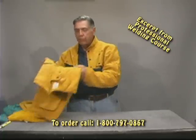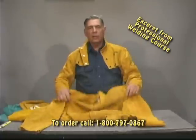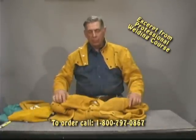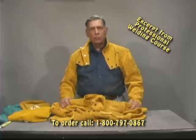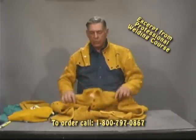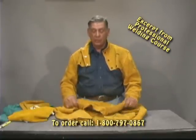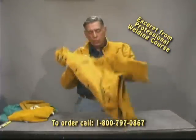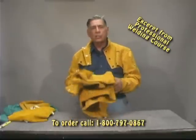It's a lot lighter than using a full leather jacket. I can't tell you how heavy it is, but I can tell you this gets heavy. But in hot working conditions where we've got to weld in a lot of high places, upside down, this will protect you. Your choice is to carry a little weight and not get burnt. At the end of the day, where this jacket might weigh five pounds now, it's going to feel like 30 pounds. So choose your items based on the type of work that you're doing. Go to your welding supply and check it out.